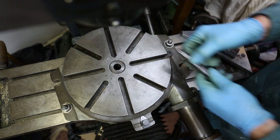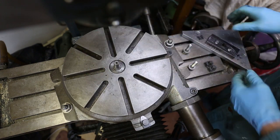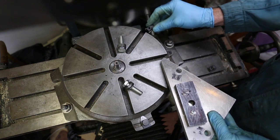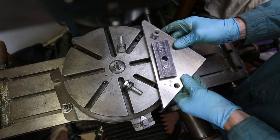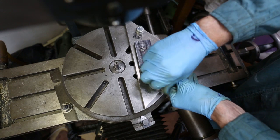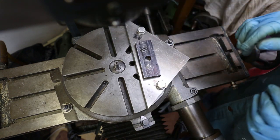Let's start to set up our plate on the table. Here's the rotary table — we start by putting the taper in the centre. We have a machine centre in the middle so we know it's bang in the middle of the rotary table. Our fixture plate is going to be held down to the rotary table through two M10 bolts going into M10 T-nuts here — the T-nuts fit in the T-slot. The fixture plate goes on top and now our M10 securing bolts go through the plate and into the T-nuts. The clearance holes in the fixture plate were 12mm, so we've got a fair bit of slack which will enable us to set up the plate against the rotary table.